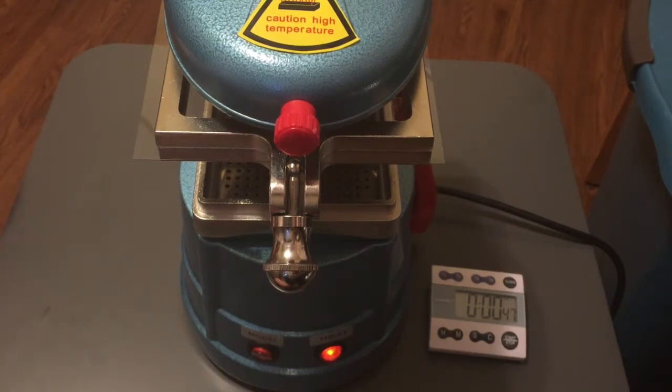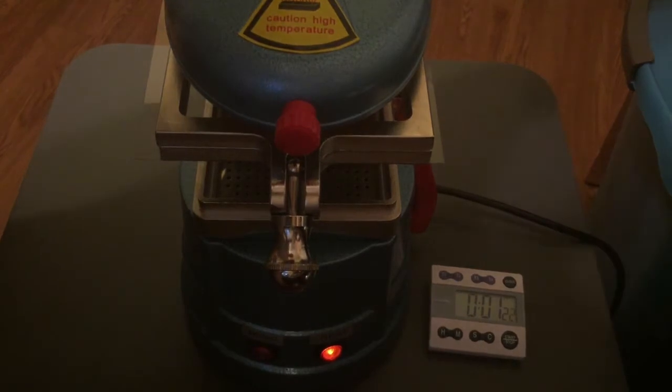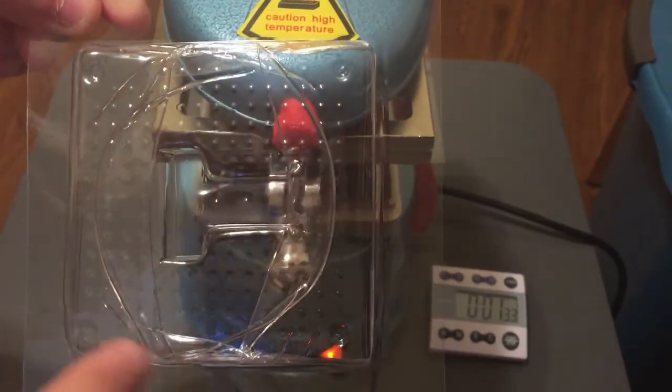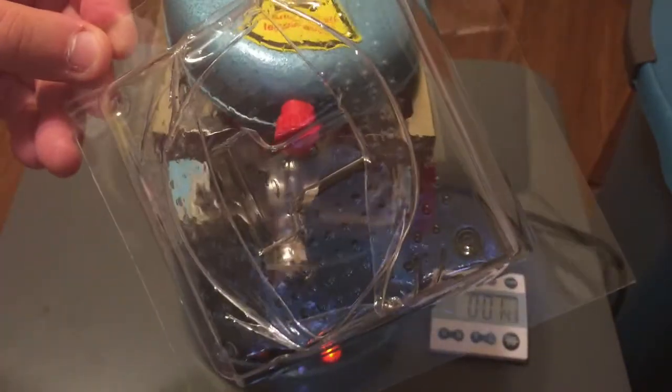Looking at other sources online, you'll find that you should see a droop of about a quarter inch as a rule of thumb. As this is heating up, you can begin to see the material at the center start to droop, and then see that droop propagate outwards towards the edges. I want to be careful not to overheat it — already made that mistake and came up with something where the material got too hot and folded over itself because it had drooped far too low to be cleanly pulled using the vacuum over the material. So that's an example of what not to do.